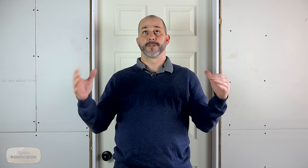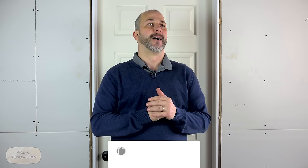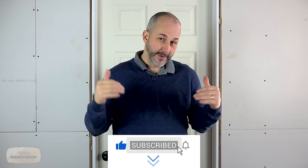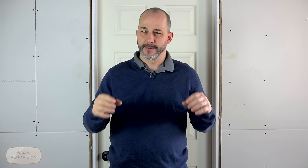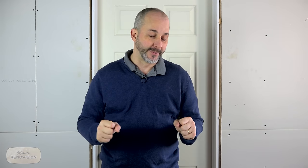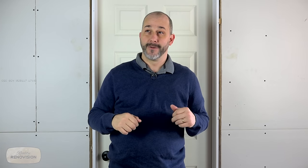Before we show you how it all turned out, let's talk about some of the rough-in decisions we made on this project and how they pertain to cost-effectiveness. Back when we shot that video, luxury vinyl plank flooring wasn't really on the market yet. Nowadays it gives us a lot more flexibility — we don't necessarily need a subfloor system unless you have a moisture problem. If your house is dry you can just go with vinyl right on the concrete. You can do the same with laminate; there are now water-resistant products. I just don't like trapping moisture under the floor, which is why I tend to push the subfloor concept, but if you're looking for economical you could put your flooring right on the concrete.